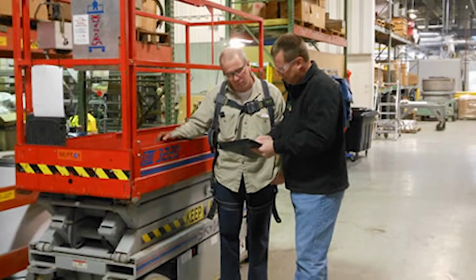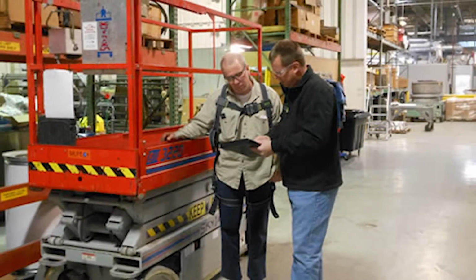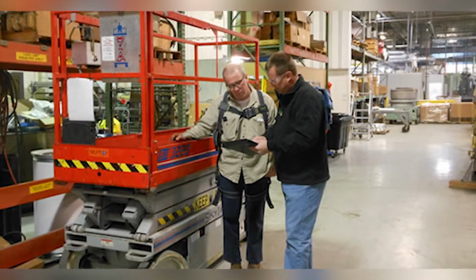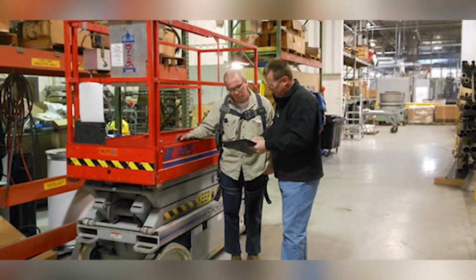So maybe somebody gets their first one. I don't know why we get some of these contacts, but somebody gets their first scissor lift and they're like, now what? Well, you better have a training program, right? Yeah. You want to make sure that the people you put in the scissor lift know how to operate it and know how to tie off. Fall protection is important because once you're up there, you want to make sure you have everything right.